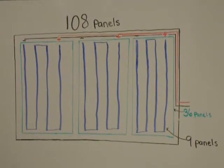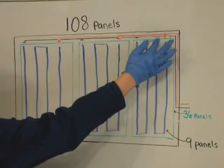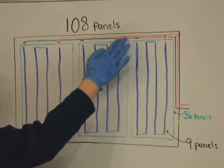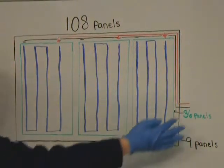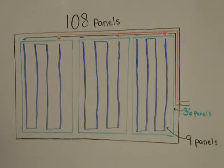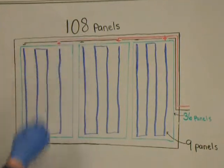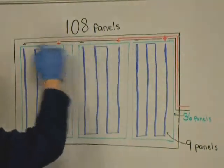You arrange them such that you have your positive end, which will be the tab wires coming from the back of the panel, and your negative end, which are tab wires coming from the front of the solar panel. These are your main wires — you want them to exit the solar panel case. You'll have your red wire connecting all of your positive terminals and your negative wire connecting all of your negative terminals.